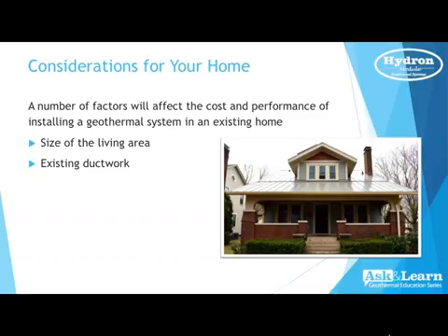For electrical capacity, when people take out a gas furnace or old boiler and install a full geothermal system, it will take a little more electricity but will not use any gas. Insulation and weatherization is also a big factor — we sell just as much insulation and weatherization product as we do geothermal, because it's so important. We want the house as tight as possible, reducing equipment size, energy bills, and overall installation cost.